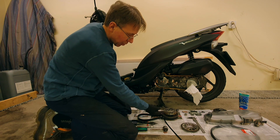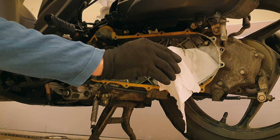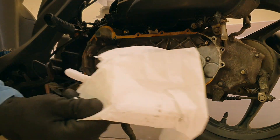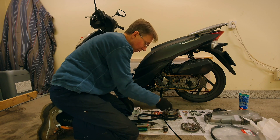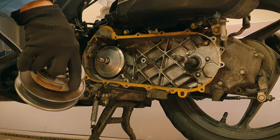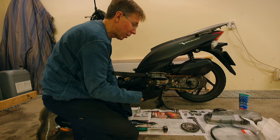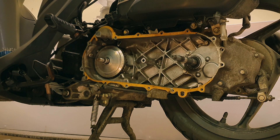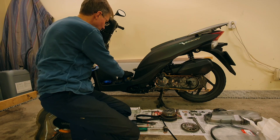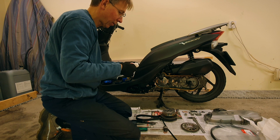Here's also the clutch — you can see three small shoes. This thing should of course go back onto this shaft. I've covered it because it's a bearing surface. The main bearing is in there, and one shouldn't put grease on these of course. There is a roller bearing in there and one doesn't want to get a single gram of dirt in there — that will ruin the bearing. It looks reasonably greased but I've been wiping off a bit, so I will just put on a slight amount of bearing grease — high load even. Just a little bit on the shaft, nothing much.